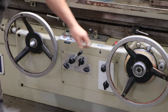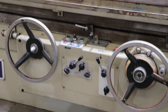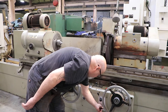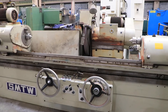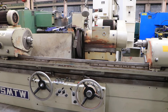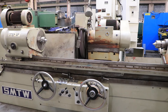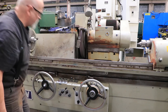With that, you've got your plunge coming in up to your wheel or up to your workpiece. And then if you turn on your feed — let's say we just want to feed on the right side — we feed there, and it should not feed over here. If we go to the six o'clock position, it will feed on both sides.